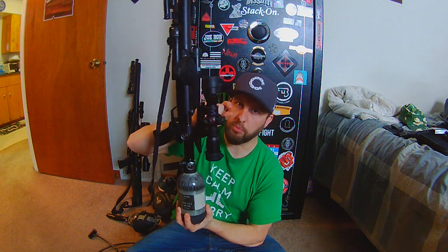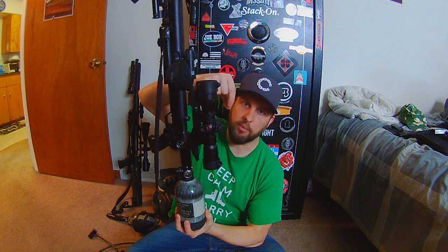Basically how regulators work: you've got your bottle pressure, then a regulator that has a piston in it. Above the piston, whatever pressure that is is going to be pushing down on the piston springs or Belleville washers, so those need to be tuned to match that strength. In this one I've got it configured for 1800 to 1850 psi output — meaning it takes 1850 psi to compress those Belleville washers. On the bottom of the piston is a seal that plugs up the tank and lets no more air through. It's an equalizing force where the springs need to be tuned for whatever output pressure you want.